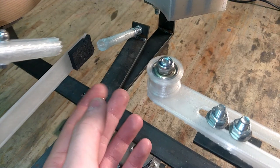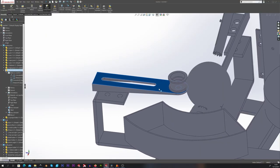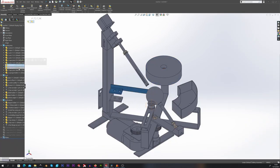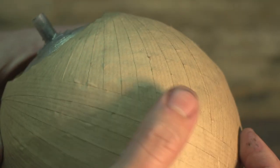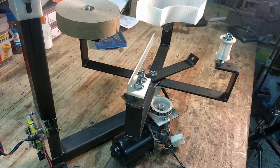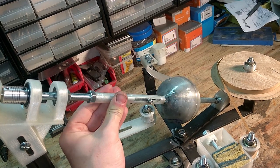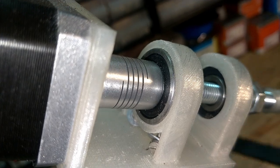This here is simply a pulley mounted on a slider, which allows me to get the pulley as close as possible to the shell and to adjust for different shell sizes. And finally, here we have literally a piece of plastic that's used to flatten the tape once it has been applied, to get rid of any folds and wrinkles. For this machine to work, the pasting assembly needs to spin around the shell, but the shell itself also needs to rotate around its poles — at a much lower RPM than the pasting assembly. Because I didn't have a motor capable of spinning at such a low RPM, I decided to use a stepper motor, which I ended up regretting later on.